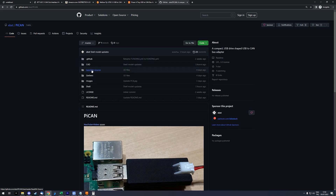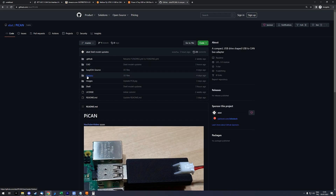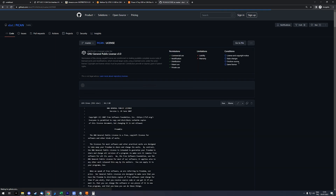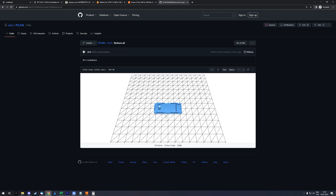On the GitHub repository you can also find the CAD files for the PCB and case. I use EasyEDA, so these are EasyEDA JSON files. You can find the Gerber files, which include the BOM and pick-and-place files so you can order from a PCB manufacturer. I license these under GPLv3, which means you can order and even sell these without paying me. I benefited a lot from open source projects in the past, so I like to give back — just like a lot of Voron design projects, this is licensed under GPLv3.